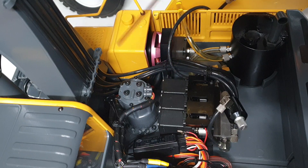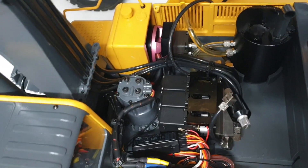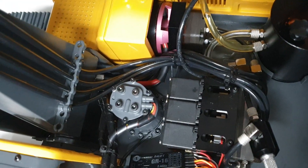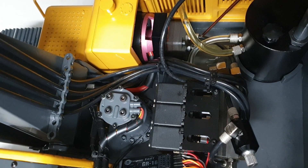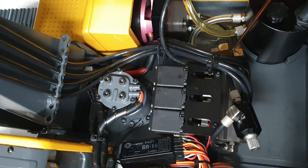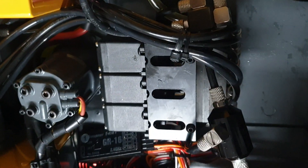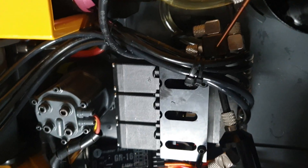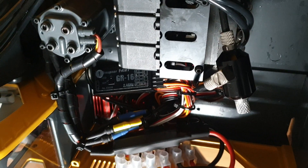The boom, stick, and bucket are all hydraulics. From the pump there is a line — you can see the diameter is much smaller, so this is the discharge of the pump — and it then comes into a manifold. The discharge of the pump comes in and then you have two outlets from that manifold.